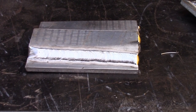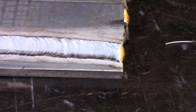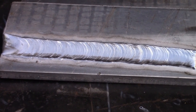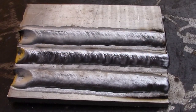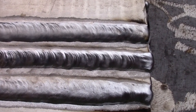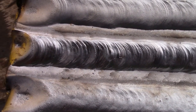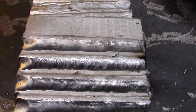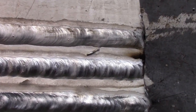Here's a look at our spray transfer lap joint in the 2F position — considered horizontal. It came out pretty good. We'll dig through here and find another one; we did quite a few. This middle weld here looks pretty good — probably the best one we've gotten so far. Nice even weld all the way through. We've just been hammering these welds down. This is the last one we did — the second one from the top — and it looks pretty good too.